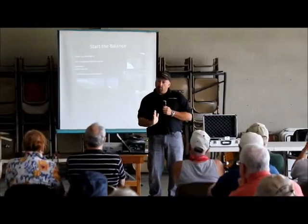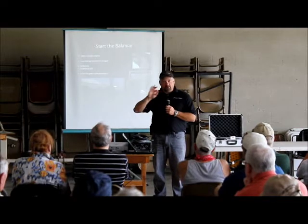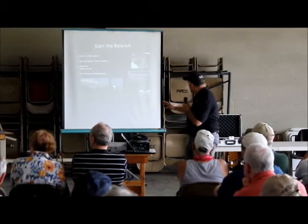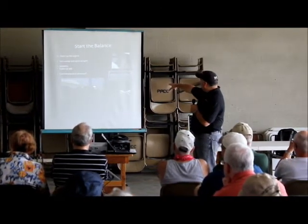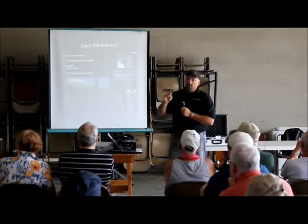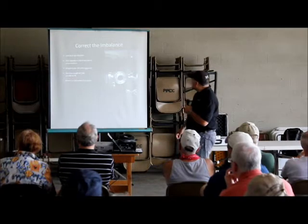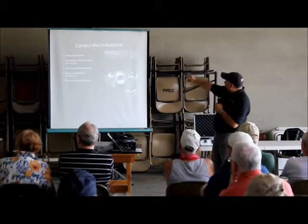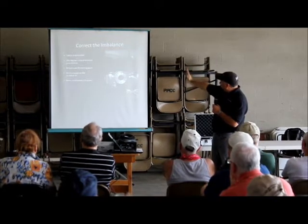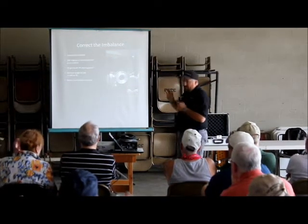A lot of people get confused — is it the blade that's zero, or is it the accelerometer? You always want to go in the direction of the accelerometer, away from the crank — that's zero degrees. The example up here is 0.88 at 258 degrees. The 258 degrees is the position of the heavy spot. I've got the propeller and the accelerometer in the same direction, so they're both pointed up. Starting at zero, you go in the direction of propeller rotation — 258 degrees, that's the heavy spot.